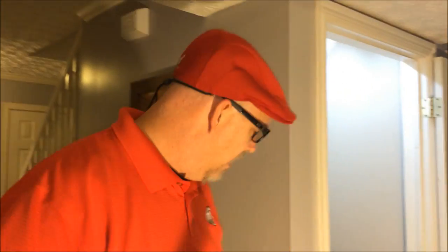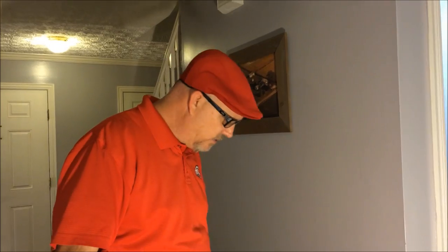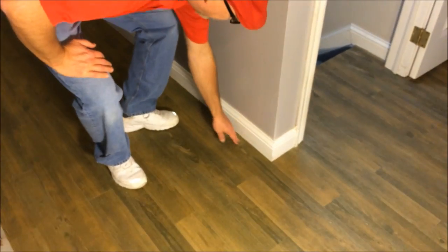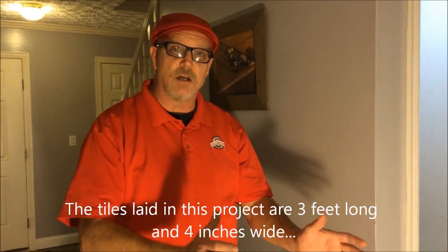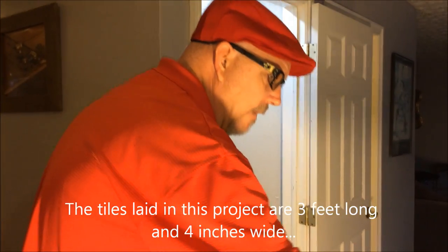So my first tile — I assumed this inner wall was square with the house, and actually the first tile was this one right here. Because thinking that this was a walk-in centerpiece of the house, I measured away from the island three feet so that the next one after that would be a full tile, then the next was two feet, and the next was one foot. So that's another consideration to give thought to.